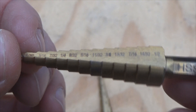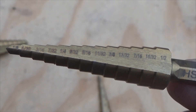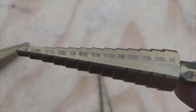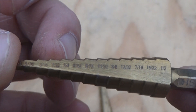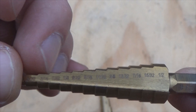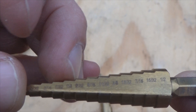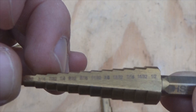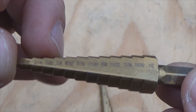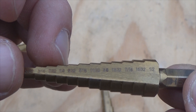If you just want to drill down to a quarter inch, you stop on this landing right here. If you go to five-sixteenths, and so on down the line to get to half an inch, you go all the way through. Say you've got a whole bunch of quarter inch holes to drill — normally you'd use a regular bit, but with this step bit, here's your quarter inch landing. You drill through your metal until you get to this landing here.